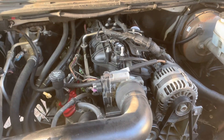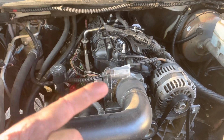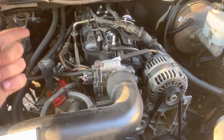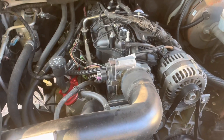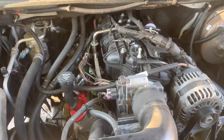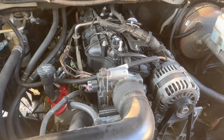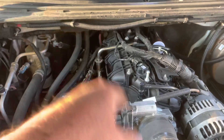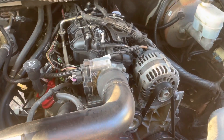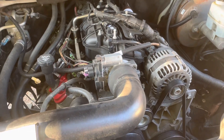It's called speed density, and what it does is it uses the RPMs. The cam sensor helps run the engine in what's called sequential mode — I've got another video, which I'll link in the description, on how sequential works. Basically, sequential means you've got eight injectors and they each fire one at a time instead of all at the same time. The cam position sensor is what allows that to happen — without it, you can't fire them individually. That's called sequential, as opposed to batch.